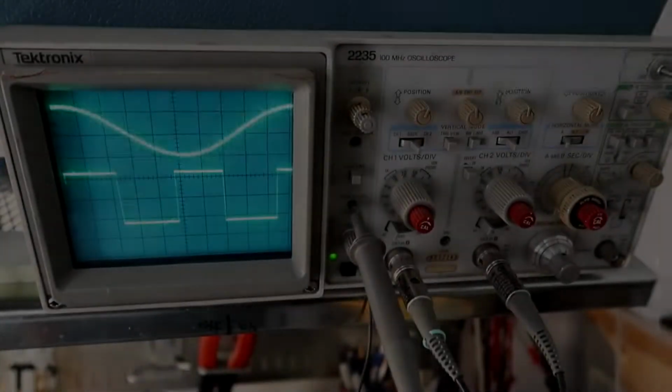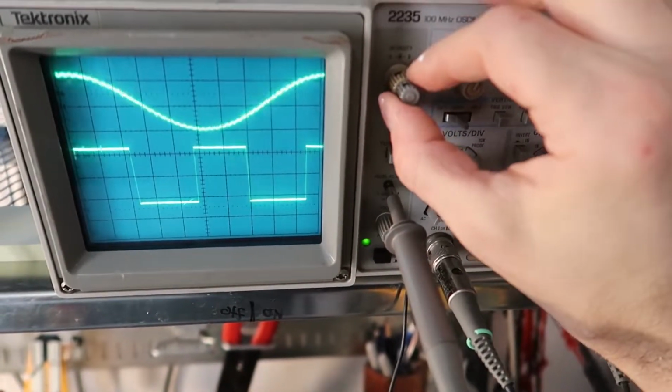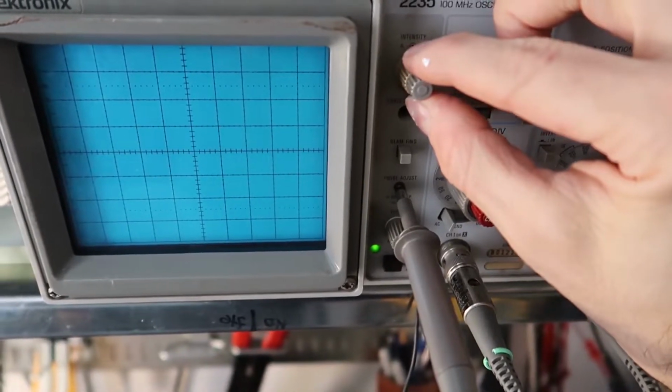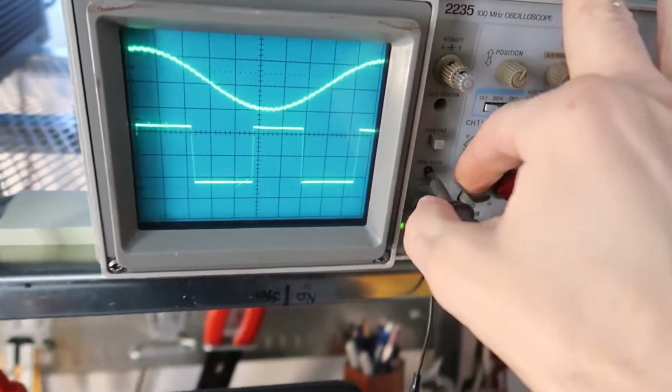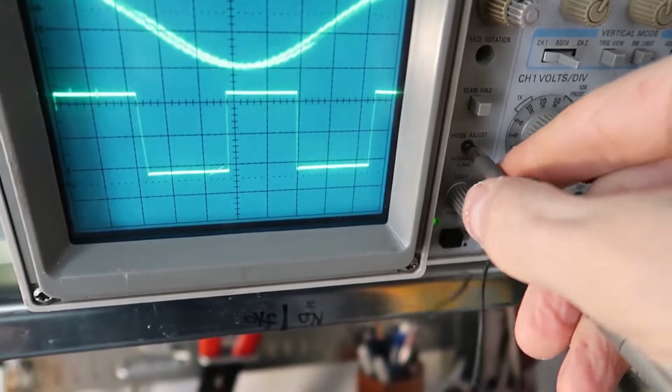sources. So first, when you turn your scope on, you might not see the beam, and there's a few reasons for that. One is the intensity knobs could be turned all the way down, and so you just have to turn them up until you can see it. The other issue is this focus knob down here could be out of focus. So let me turn this back on.